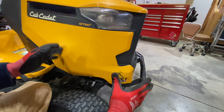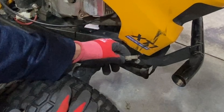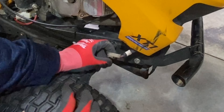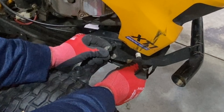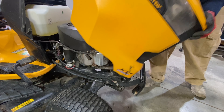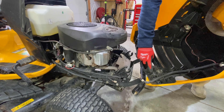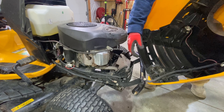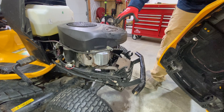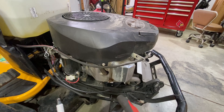To start, I'm going to take the hood off because it's very easy on this mower. You just pull the hood up, there's one little harness on this side controlling the lights — you just unhook that — then lift up and it comes off. It seats in right here with these little plastic hinges. It comes off that easily. You might as well go ahead and get it out of your way — it makes life a whole lot easier.